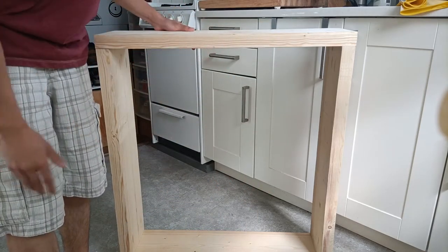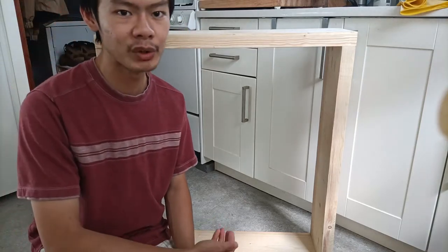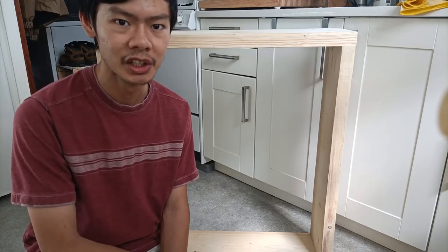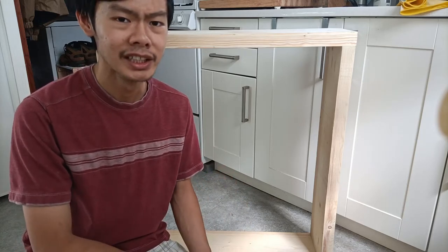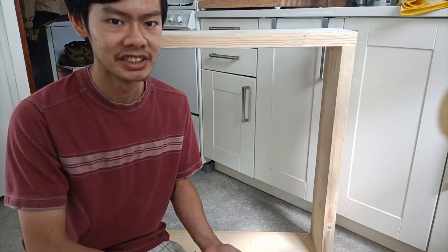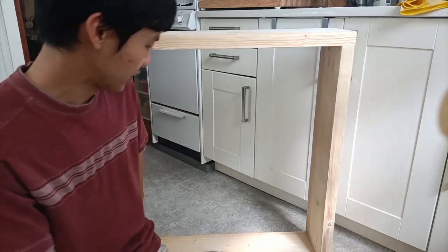It's actually a 2x8 and I cut them up with my miter saw. The reason I don't get anything bigger than 2x8 is because my miter saw can't cut anything bigger than that. Although you can flip the wood and cut the other side, I realized that causes inconsistencies.